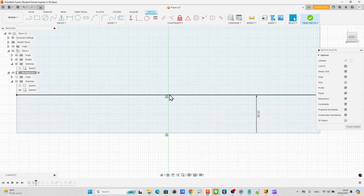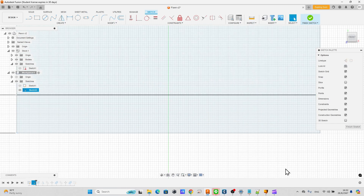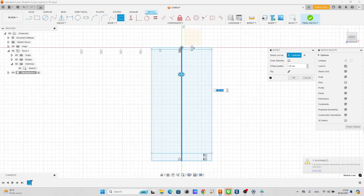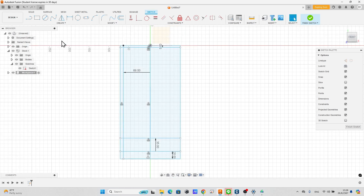Offset the top line to make the workpiece lower than the stock, at 5 millimeters distance. Select the offset symbol, right-click and delete to remove the offset relation. Offset from the center line — this is half the width of the workpiece. Offset a line from the bottom line at minus 35 millimeters, then another offset at minus 180 millimeters.